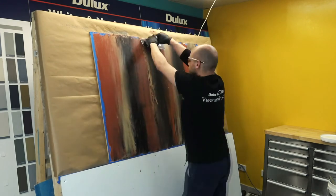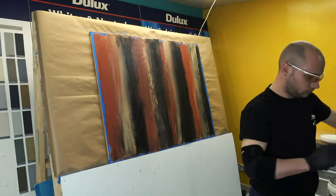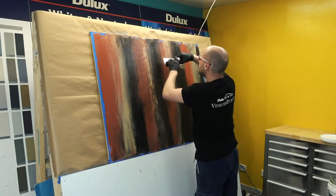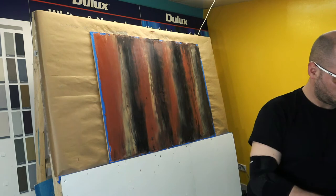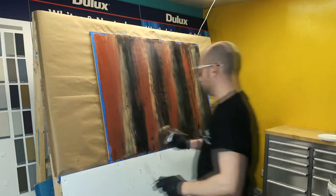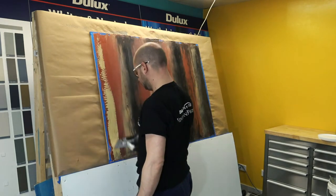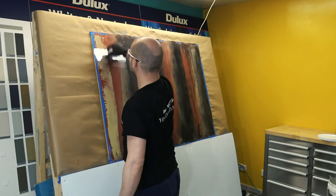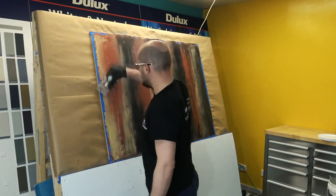Allow the product to firm up, then spray a mist of water onto the Modello and begin to trowel and compact the surface, following the same direction as the pattern. Allow to dry further. More adjustments can be made while the Modello is still wet.